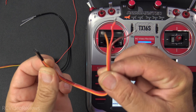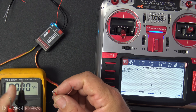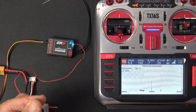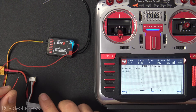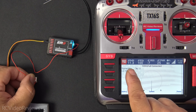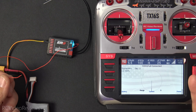I'll check the BEC voltage with a multimeter using a pigtail plugged into the receiver. Since it's a common voltage and common ground, any pin works. I'm seeing 5.54 volts on the multimeter — the radio shows 5.5, which is right out of the factory and looks great. Now I'll demonstrate the VBAT auto-toggle: connecting the VBAT lead to the positive on the balance plug, the telemetry jumps up to 11.3 volts. Remove the VBAT lead, and it drops back to 5.5. It automatically toggles back and forth — really cool.